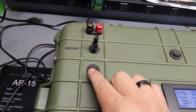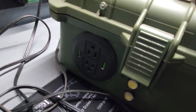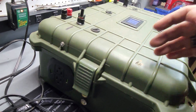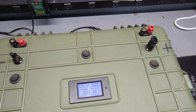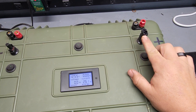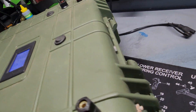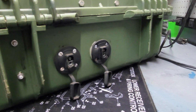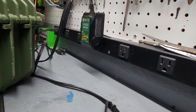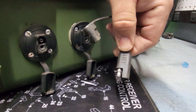This switch does the inverter. So this is a DC power box and I put an inverter — I think it's a 500 watt. When you flip the switch, it turns the inverter on and then you've got AC power — you can plug in a fan, whatever. And it has multiple charge ports. This is for your solar panels, like 100 or 200 watt panels. And then the back side has two more. This one is meant to be charged by just something like a battery tender, and then this one charges with a solar panel if you have these connectors. There's multiple ways of charging.